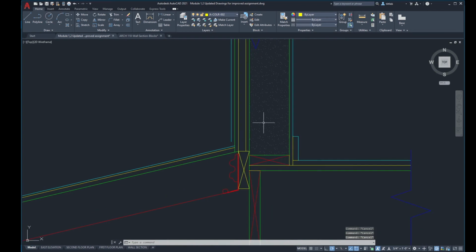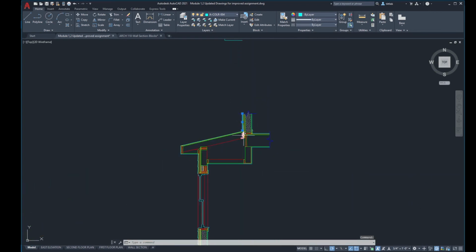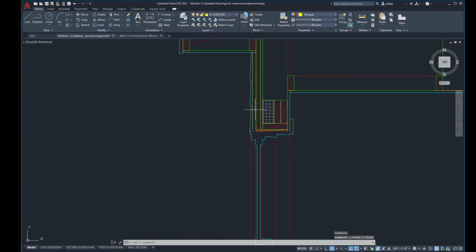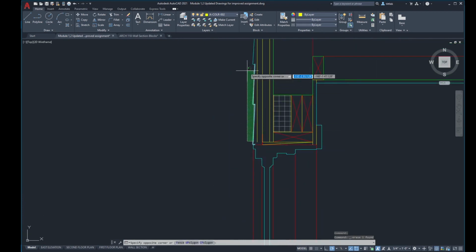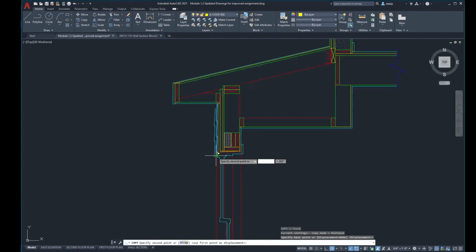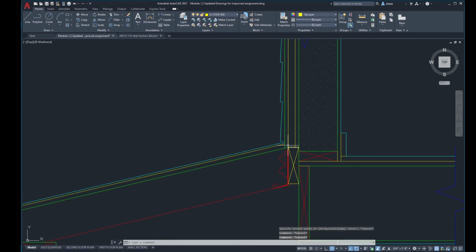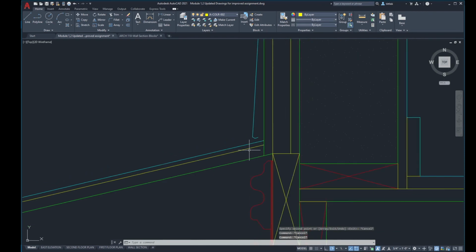Okay, that's in. What I'll do again is grab, let's go down to our window head, and we're just going to grab all of this and copy that from the base point of our furring so that we can go right up to our furring line. Where is our furring? That's 1 inch. Okay, so that's furring. That's right there. And I'll just bring that up just above the wall. This blue line can overlap a little bit like that.